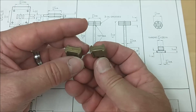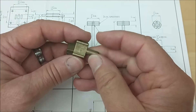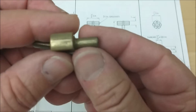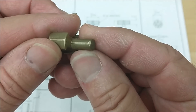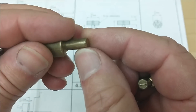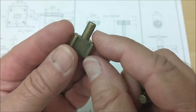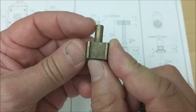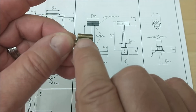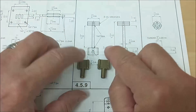There are two of them naturally. Before I grab a hold of this and turn it, I'll give it a full inspection — check to see how round it is. It's supposed to be 0.250". You can see we have a parting line on both sides, both pieces. My first operation may be a vertical operation in the middle against a backboard so I can establish a central finished lug, then turn it and spin it off, ending up with equal lands on either side. Every detail counts.